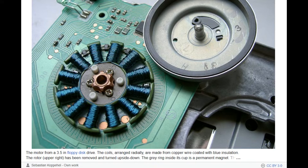But the trade-off is, with DC motors, you just give them DC power, +5 volts or -5 volts, and it rotates forward or backwards. You can PWM to change the speed. With brushless motors, you have to have precision control of the three phases. Like the stepper, each phase has to be turned on and off exactly at the right timing to make sure that you have smooth motion. So you can't do it without digital electronics controlling it.